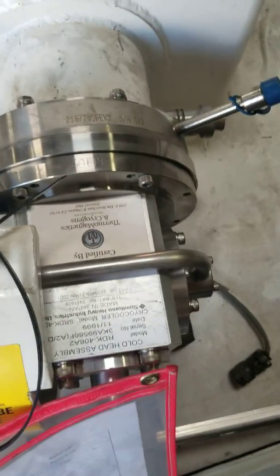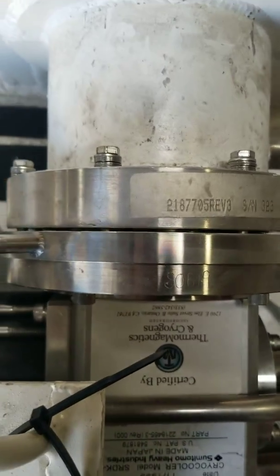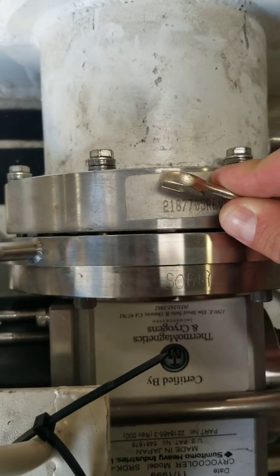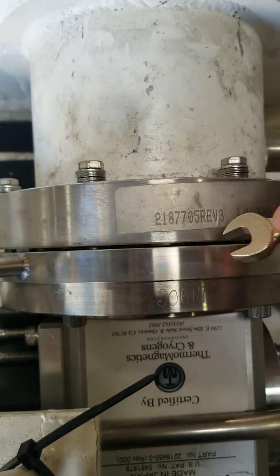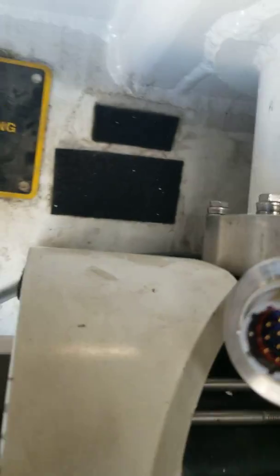This is the cold head, and this is where the cold head meets the flange. We want to evaluate whether or not the cold head was put in straight — it's this spacing here, that space. We look around the cold head and make sure that it's even all the way down, and make sure it looks even and straight, not tilting from one side to another.